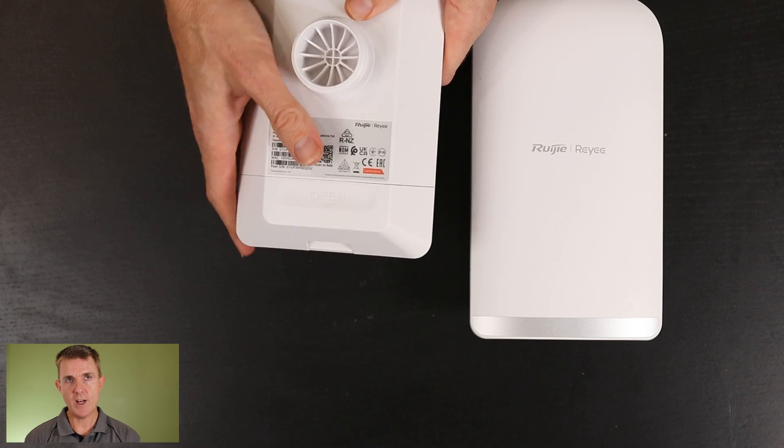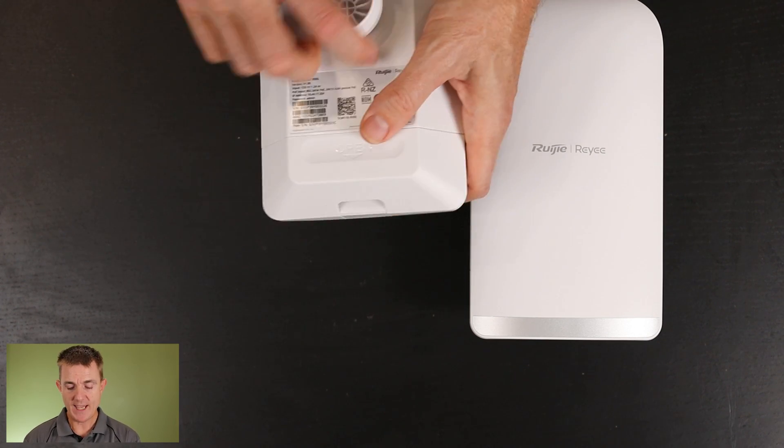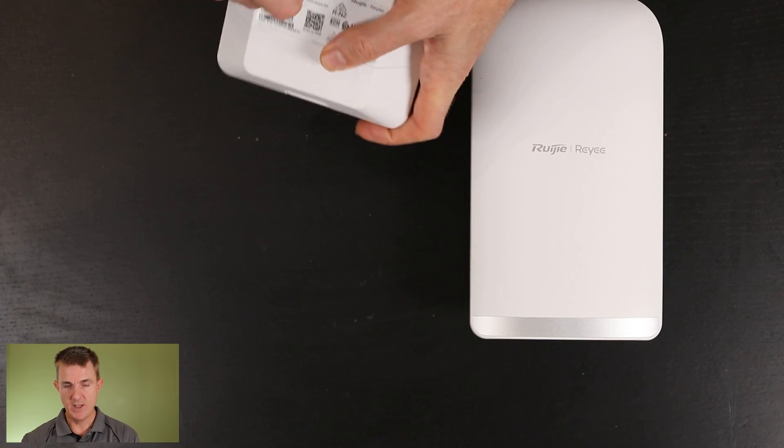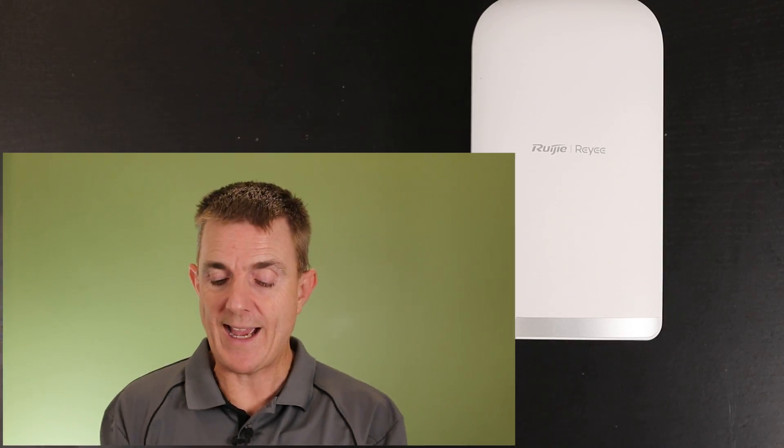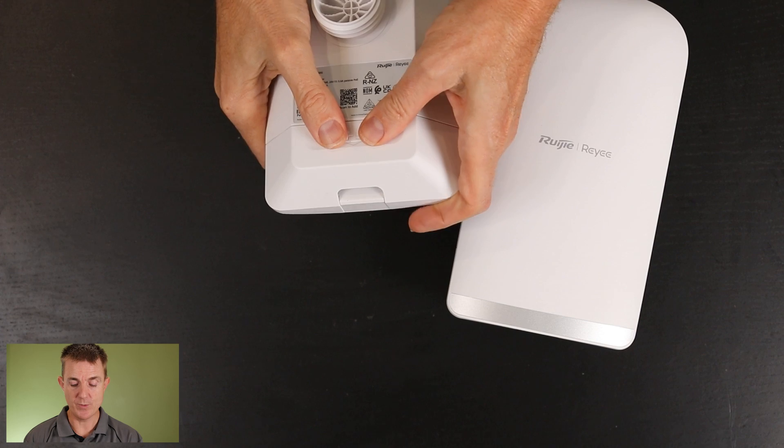Is this usable outside? Yes, this is fully weather rated. Your cable is going to come up through here and come quite a long way inside the unit. We really need to do a drip loop with something like this. If we have a cable running down slightly or even slightly upwards, we can get water travelling upwards as well as downwards. When our cable comes up the pole or through a hole in the wall, we need to come up somewhere higher than the unit itself, then come down into a loop and back up. Any rain or condensation that travels down the cable is forced to the bottom of the loop and drips off, meaning the unit is perfectly adequate for outside. You do have some extra options to seal this once you've put the cables through.